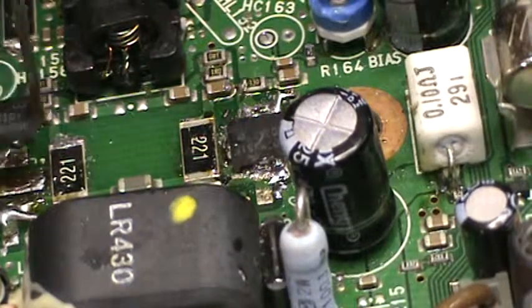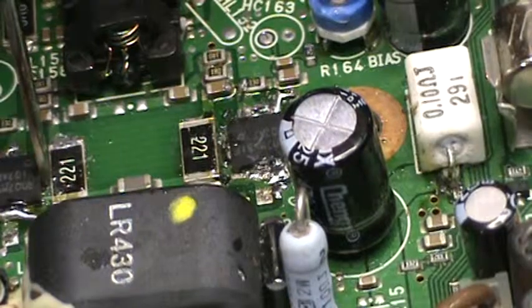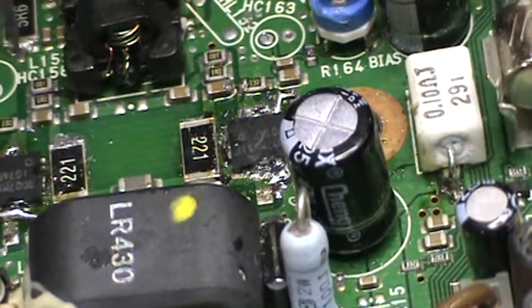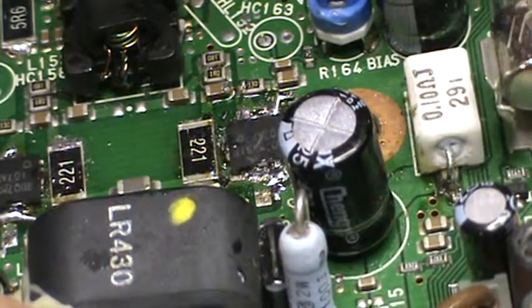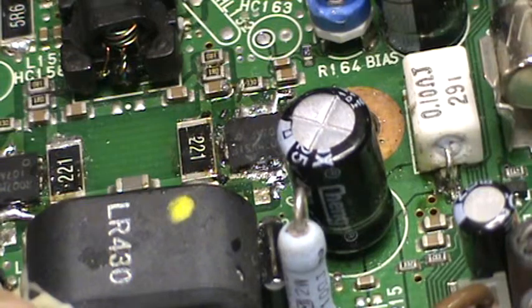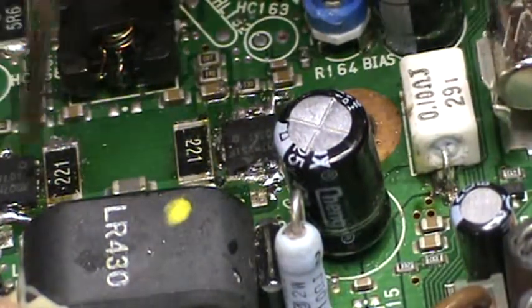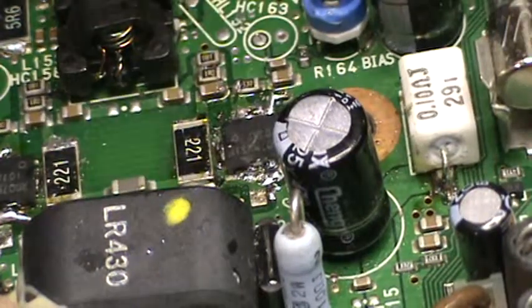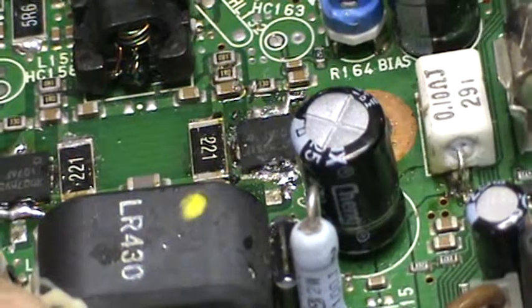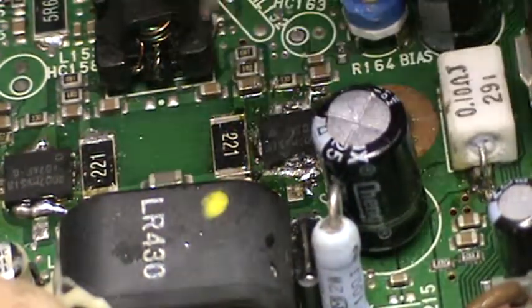The chips, as you can see, are up to temperature, so they readily move around until you pick them off the board. Then they're cool, and that is bad for them, by the way, to allow them to cool a great deal rapidly. When this is over, you'll notice that, well, that's hot, that I just shut the board off and leave everything where it is. That's to let it cool on its own.